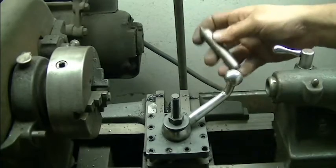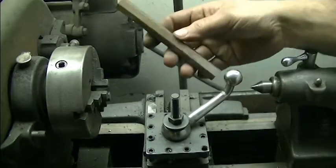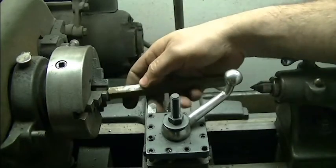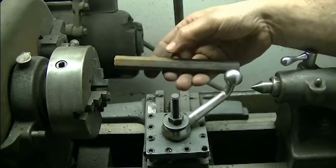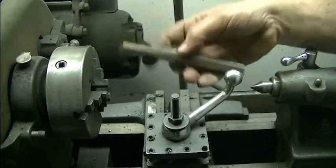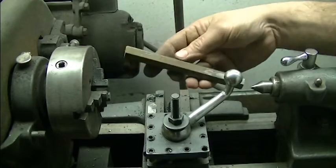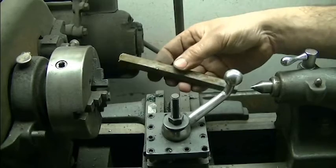So how can we get by? How can we get the job done? What I'm going to do is take a piece of hex stock — this is regular mild steel. I'm going to cut this in half, and I'm using hex stock because I have a three-jaw chuck. I'm going to face it and put a point on it. I'm not going to harden it — I don't even know if it can be hardened or what kind of steel this is. But I need this to work for ten minutes tops, and even if it destroys itself in the process, it's still worth it to get the job done.